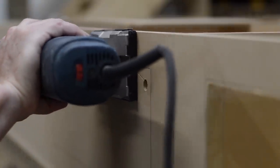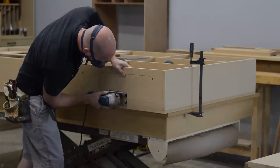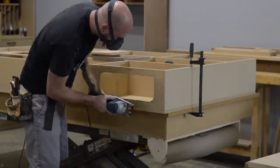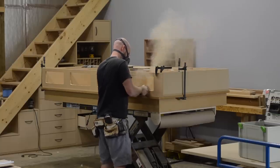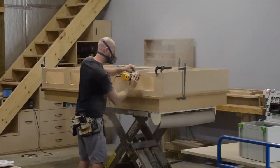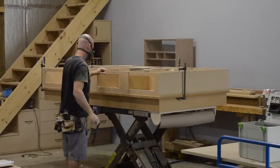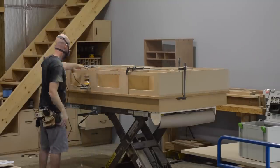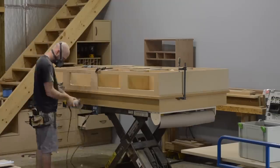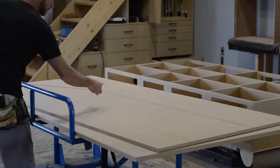After the templates I rough cut with a jigsaw, and I have to say these barrel-style grip jigsaws are absolutely great — they really offer more control than a traditional handle. Immediately you'll notice the one downside to using a router and a template, and that is the insane amount of dust created. This shot is actually a good illustration of why I want to put a vacuum into my workbench — I want to continually improve dust collection to keep my environment cleaner. One mistake I've made in this build is I should have done these cutouts before gluing the grid work together so I could have put a small roundover on that inside edge.